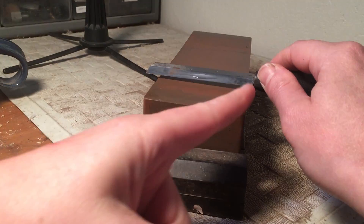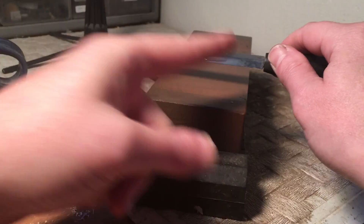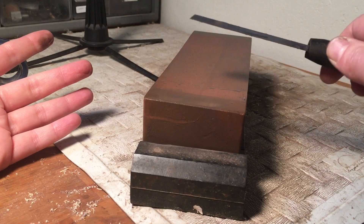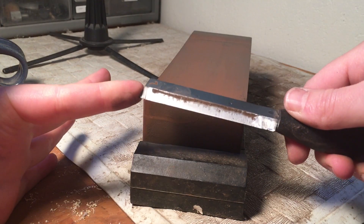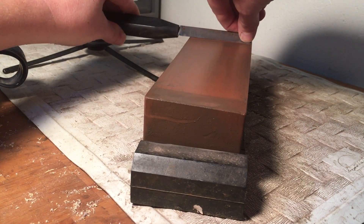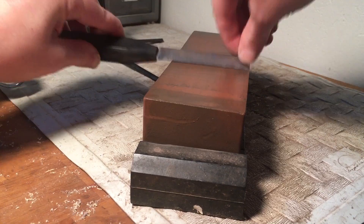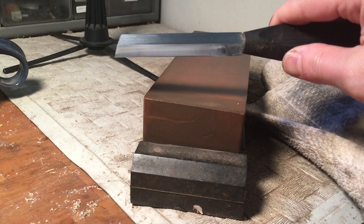I'm pretty much just sharpening from here to here because that's the portion of the knife that I scrape with. I don't use this bottom end, but if you do, you can do even strokes to get an even edge all the way across. There are two ways you can do this: you can flip it over and go away from you, keeping the beveled side flat on the stone. Or what I like to do is switch hands — since I'm right-handed, I like to use my right hand to hold the blade down, as this feels a little more secure. If you're comfortable with your stone, do some motions back and forth, then use a rag to wipe it off and move on to step two.